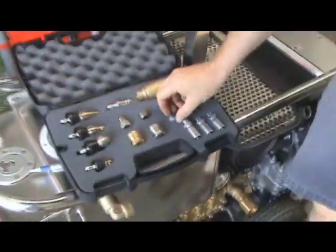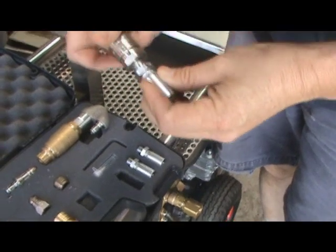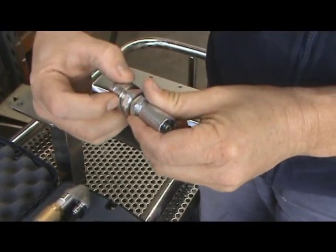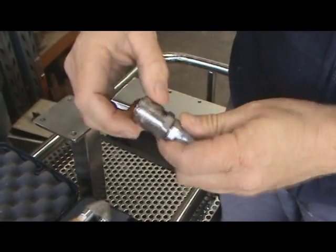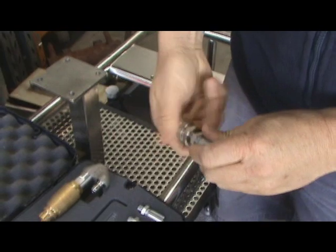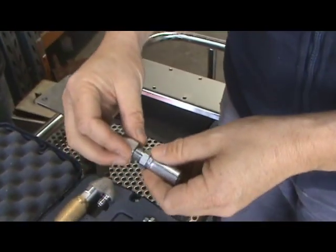Over in our nozzle box, the large nozzle box comes with spare tails to screw onto the quick release. These quick releases have an O-ring to stop silt getting in, and an O-ring inside - it's a double silt-proof O-ring with eight stainless balls, as opposed to the six that others have.